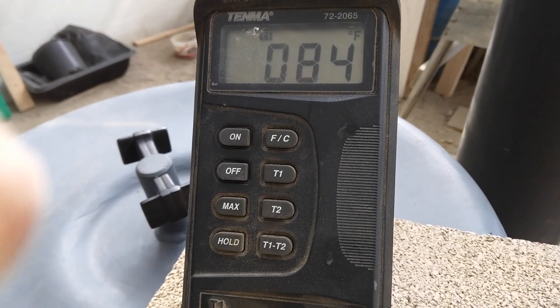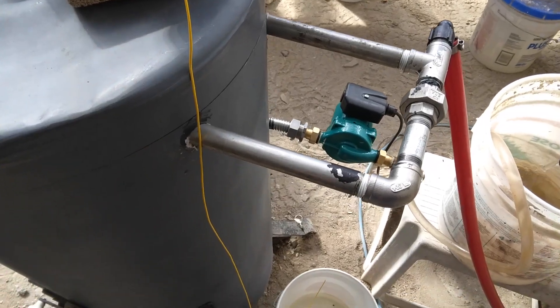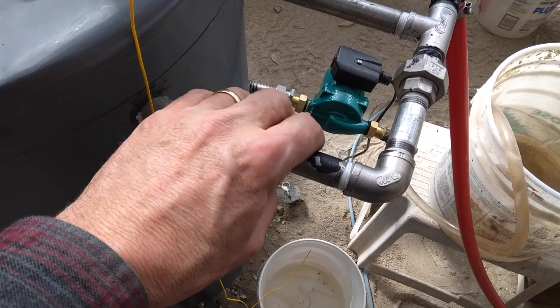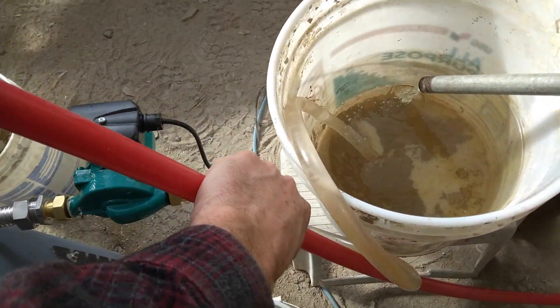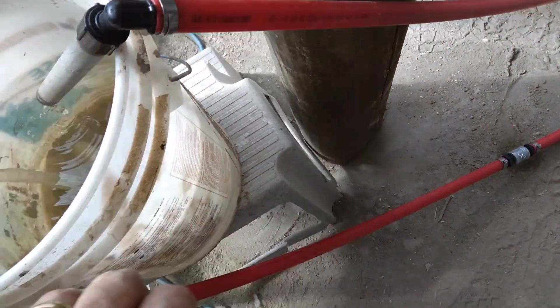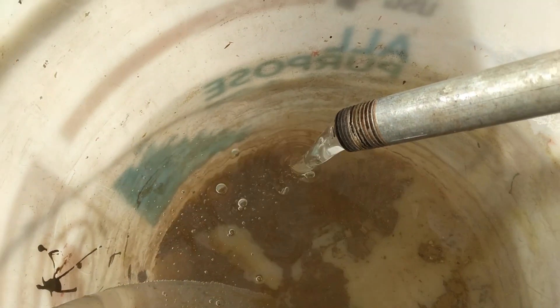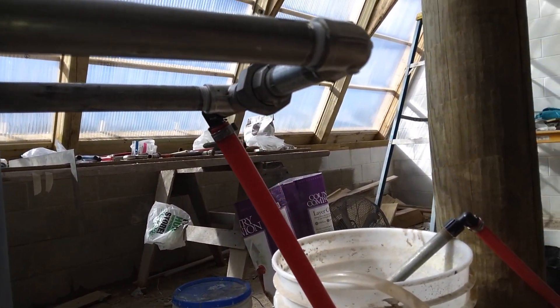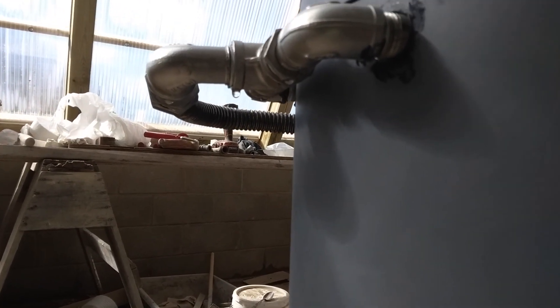The return line is still 84 degrees. I'm not quite sure how accurate the outgoing reading is right here — it's too hot for me to touch; it feels like it's probably over 160 degrees in this pipe. I can feel a big difference in the tubing for sure. There's still a little air in the loop — once in a while I get some bubbles coming out. There's a little drip here and there; I know I'm going to have to take that apart and put some pipe dope on to get them sealed up.